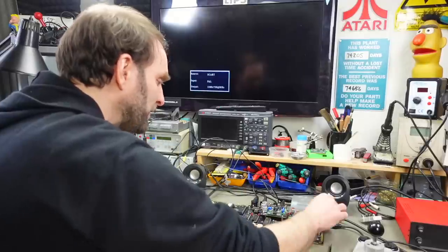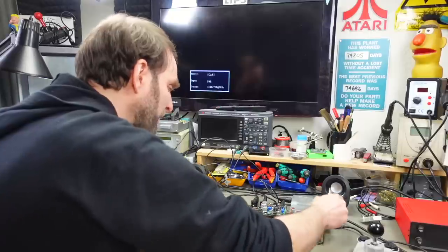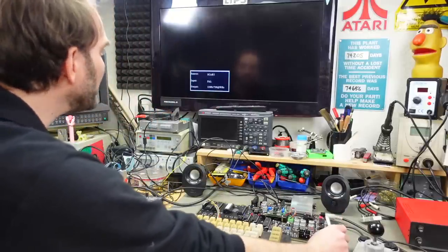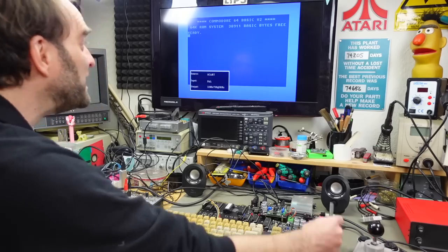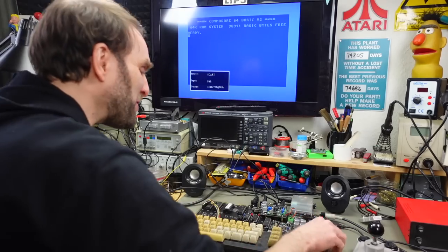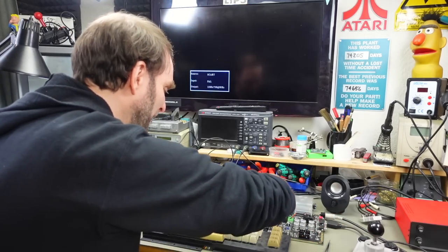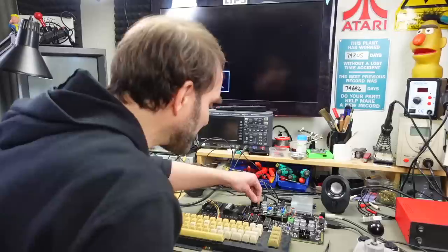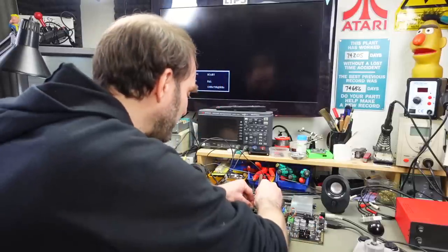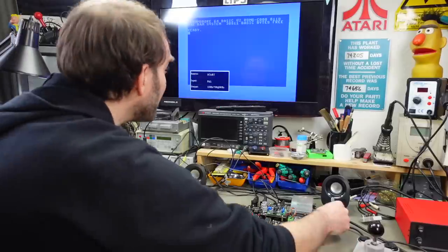The first three jumpers are for the character set, I think. And we can set those up in different positions and get different character ROMs. This looks like the Amiga font on the C64. Yeah, endless possibilities basically, as long as you have 8x8 pixel fonts there. And then we have obviously the capability of switching to different kernel ROMs. That's a different ROM, ROM 6.